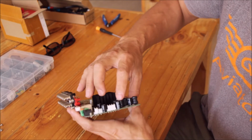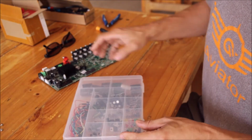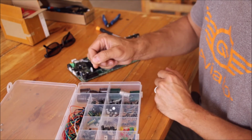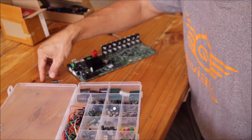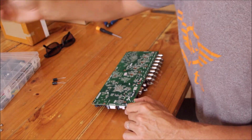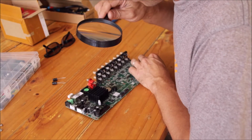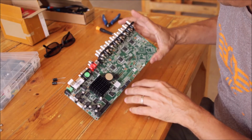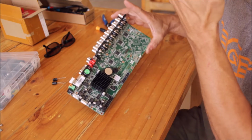So these capacitors are 470 microfarad 25 volt capacitors. I have my box with electronic components and have the exact same ones here too, so no problem with replacing the other ones. I would say absolutely nothing else to see, and so it's obviously only those 2 capacitors which might cause a problem.